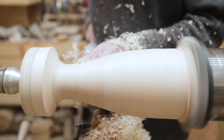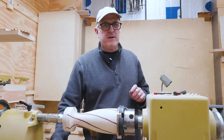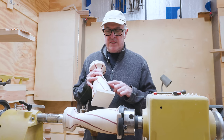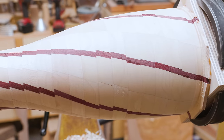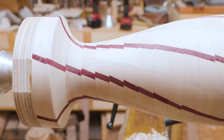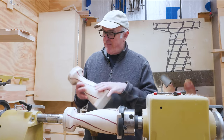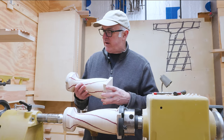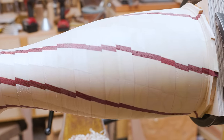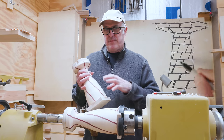I was beginning to think I had a little bit of a problem with the pattern. I've run into a problem that I should have known was going to happen — it's a lot harder to align the rings as you glue them up, and trying to get nice clean strips that twist around the piece really doesn't work that well. They're kind of very misaligned. The quick fix is to just cut off the bottom section because the top actually doesn't look too bad. The better solution maybe would have been to glue the rings with more of a random pattern as they move up the piece, so you don't get the strips not quite aligned.